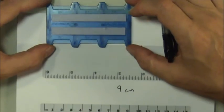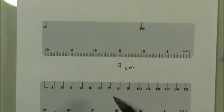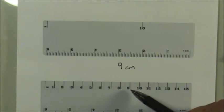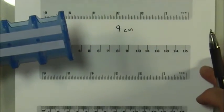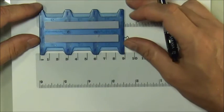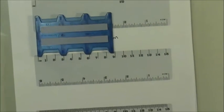Now I have a second ruler. The difference between these two rulers is that this one is more precise — there are more markings on it, more finely graduated. Rather than a mark every 10 centimeters, there's now a mark every centimeter, so this has greater precision. When I put the device on this ruler I'll be able to see if I was right — was it really 9 centimeters? I'm expected to get one more decimal place. I'll do my best to line it up on the zero on the left side, and let's zoom in a little bit.